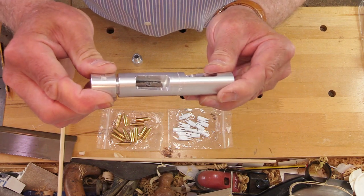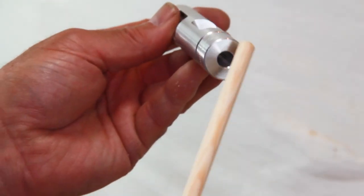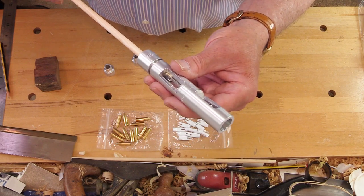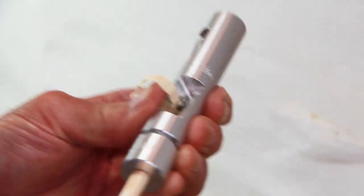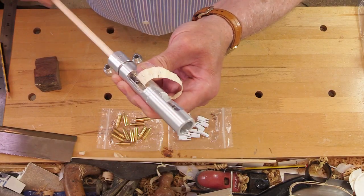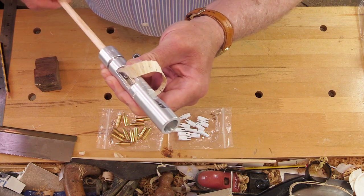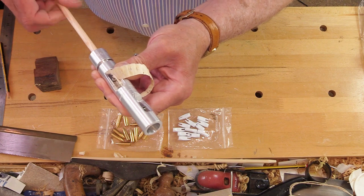So you push firmly in — this is the pile end I'm doing at the moment. The shaft goes in and we start turning. It cuts very, very fine, shaving off, and you keep turning until it doesn't do any more. It won't keep cutting the shaft until there's nothing left — it will revolve and that's finished.